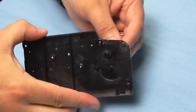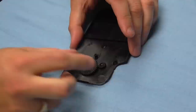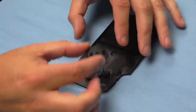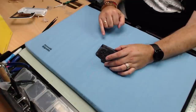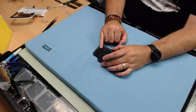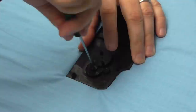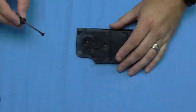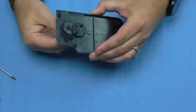We've got two more cogs — a bigger one and a smaller one. The smaller one with the gear on top goes in interlocked underneath first, then the bigger one with a tab goes next to it on that section. Now when I operate the winder you can see they all turn. The smaller cog is held in with an HP screw and the larger one with a UP screw — that's a flange screw. You don't want the UP screw too tight — you want it still to be able to operate. And as you can see, it operates no problems at all.